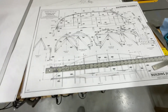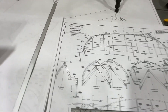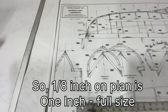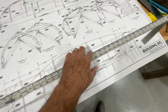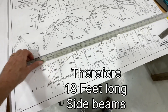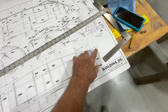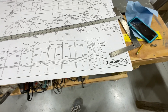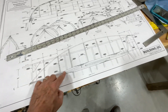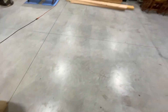This is a page of the plan for the building jig, and you get a lot of information here. The scale on this is one and a half inches equals one foot. One of the first things I did was look at this side beam — when I measure that out, it's 27 inches divided by one and a half, which is 18 feet. It sticks out past the front at least a foot, and same deal at the back. This just shows half of it, so it's 24 inches from the side beam into the center line, which means the whole thing is going to be four feet wide, and we've got plenty of space right here.